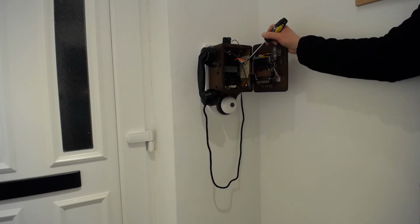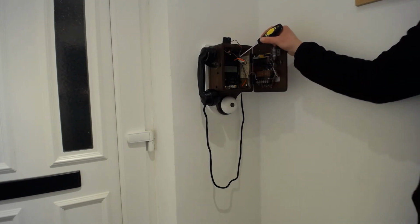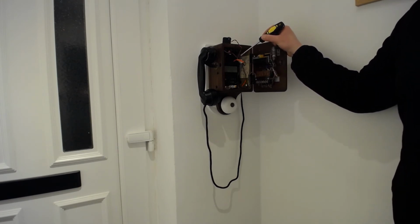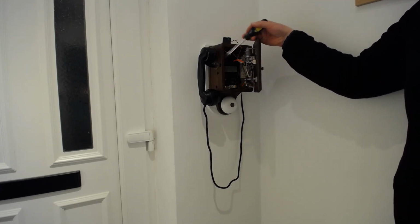It just uses an inductor, because the inductor serves a couple of purposes, but the primary one is it means you can't quite hear the microphone on the speaker. So it tries to stop you hearing your own voice so much. I don't think it works very well. It's probably a knackered inductor, I suspect. But anyway, yeah, so to feed that, the speaker of it actually is fed directly from BT.